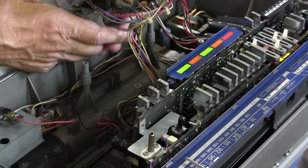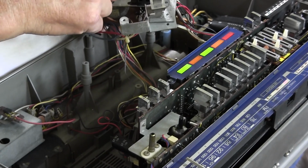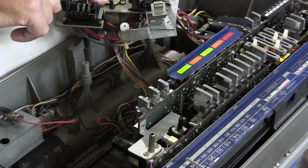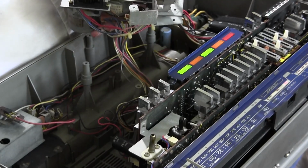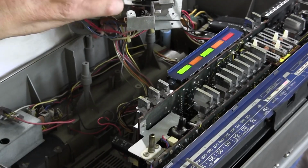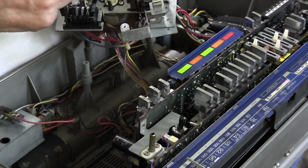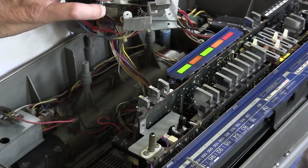Now the only thing I could think of would be that this white ring around the gear, which turns everything, I would think there would be some kind of friction plate in there to go between the two, so that when it does rotate in the one direction, it would push the gear over by way of a very light friction to make this engage. But it's not doing it. It doesn't do it to this side either for when it's in play mode. So I don't understand this.